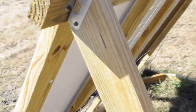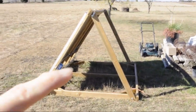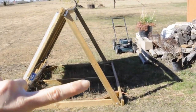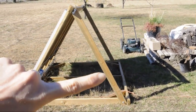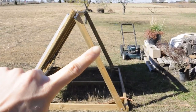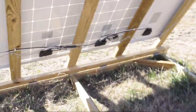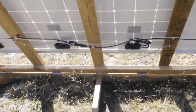For the angle adjustment beam — right now it's adjusted for winter. During the summer the angle will be almost down to the ground, really low. During the fall and spring it's about right here. That's all dependent on where you're at, what angle of latitude you're at — latitude and longitude — be sure to look it up.